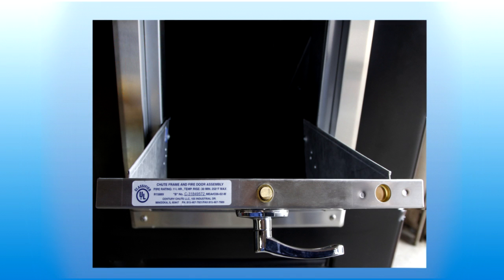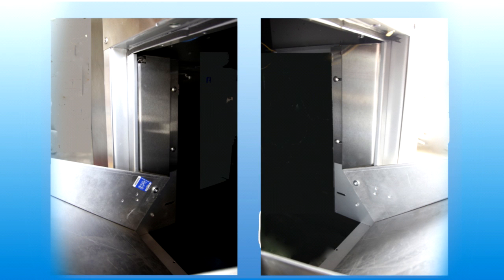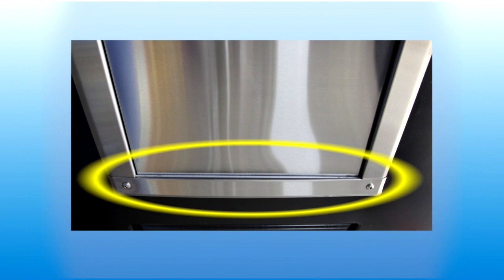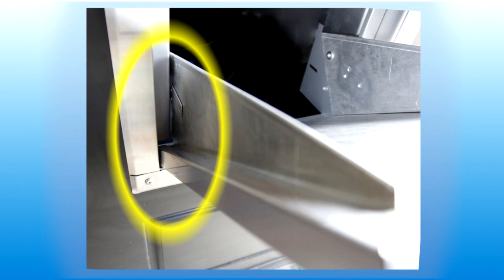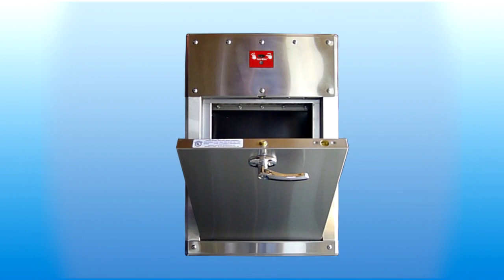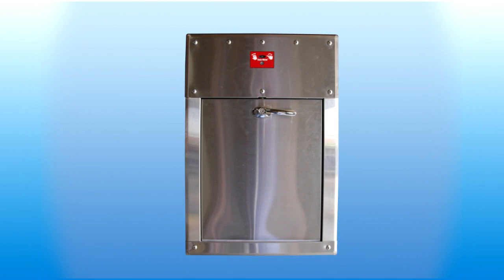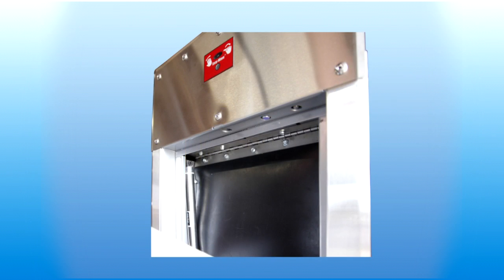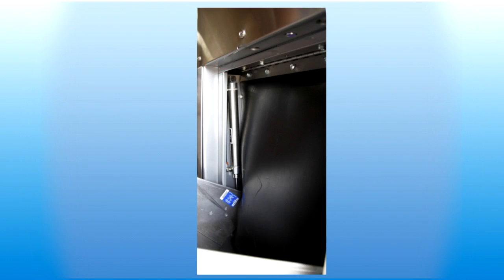The door opening is designed to funnel material into the chute and away from the opening. Bag all waste to prevent small items or loose material from becoming lodged or jammed in any part of the door frame, hinge mechanisms or brackets. Do not lean on an open door or apply any excessive pressure. Never force a door open or closed, and ensure clearances around the door frame are maintained. Any obstructions preventing free movement of the door may cause problems with the control sensors, interlocking latches, and actuator mechanisms.